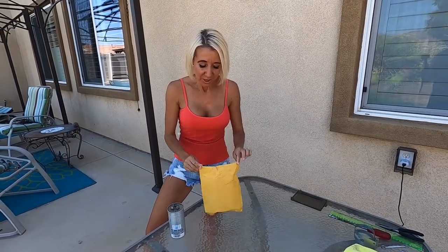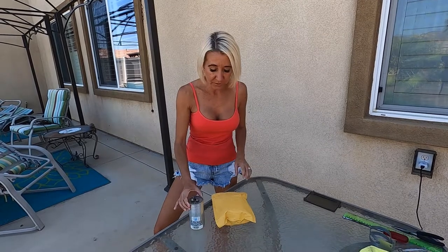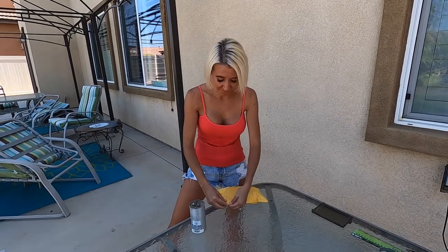By the magic of movie making, my new capacitor has arrived. To determine which capacitor I needed, I took my old capacitor, took the numbers off it, went online, did a search, and found the exact same capacitor. If you call an air conditioning company out, they're going to charge you hundreds of dollars. I was able to order this part and have it shipped to my house for less than $20, and I'm doing the repair myself. A capacitor will only run for about five years in your air conditioner, so if your unit is still working after five years, you are running on borrowed time.